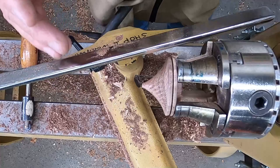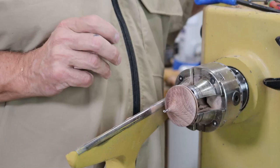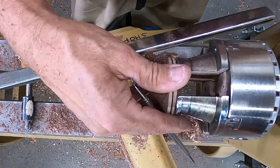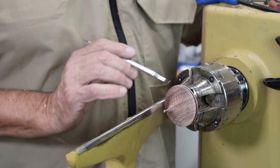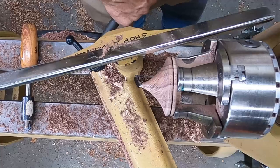This is the eyelet I put in. The main thing about the eyelet is you do not let the machine run while you're putting it in — because that hurts. The last finger I broke was this one: I was spinning the chuck and my finger got stuck, and where the tool rest was it went down. I literally heard the bone break. So I've got this dental pick and I stick it there, then turn the handle. Keep your hand away from the chuck jaws sticking out — it does hurt.